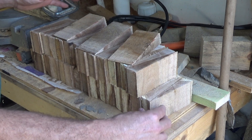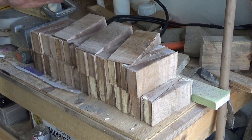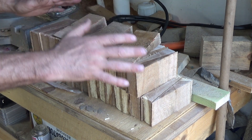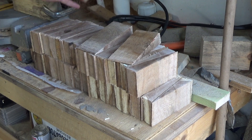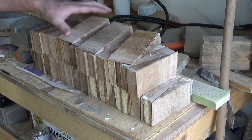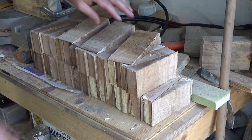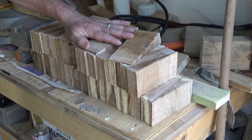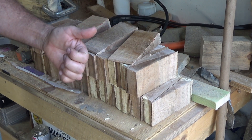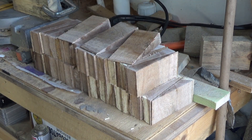If they split, break, or get lost, I'm not losing money — I'm just losing something that was destined to be firewood in the first place. That is very satisfying. I'm going to space these out with a little airspace in between each one and leave them on a shelf in the garage, out of the sun and out of the wind, and they'll slowly air dry. They likely won't split or warp under those conditions since they're so small. Please like this video and subscribe if you haven't — stay tuned for more cool videos to come. This is Troy from Country Wood Products, talk to you later.